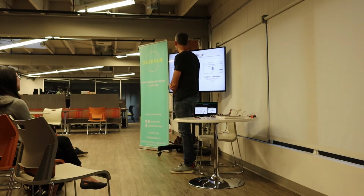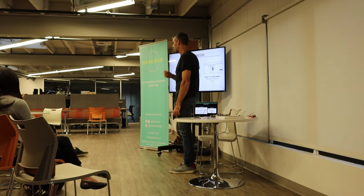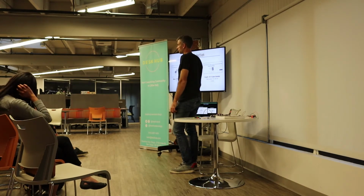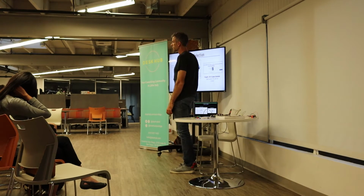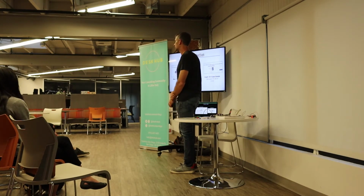The other thing you can do with a lot of this stuff, I mean, these Pololu motors are like $15, $20, just get one, try it, and if it doesn't work, you get another. Because usually that's the thing, right? If you try to do something too big with one of these, they'll hit the stall current, and they won't be able to go any further. They're not gonna explode, they're just gonna not do it. I've had bad experiences with some others. You can also break them, but if it's a little dinky motor and it breaks, well. So that's kind of a fake answer.